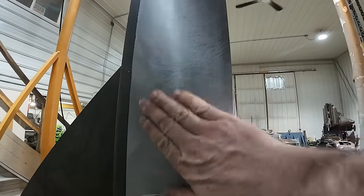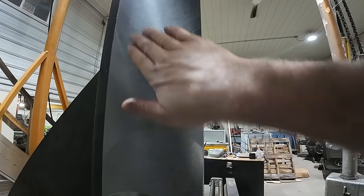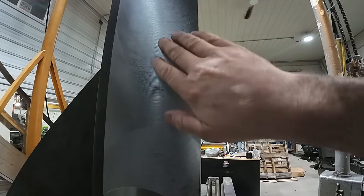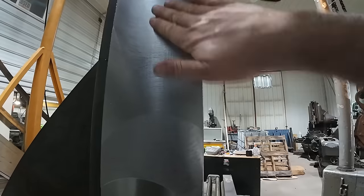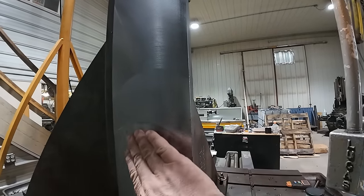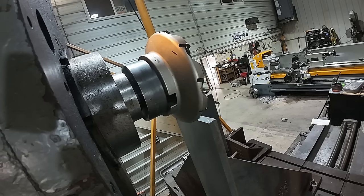That second angle plate up there really made a difference with those jacks. That's really a lot better finish than what I expected. We may do the last pass with a slower feed just to smooth it out, but boy, is that nice. So we'll go ahead and we're gonna take 25 and get us down to this, and then we'll see what we need to finish it up.